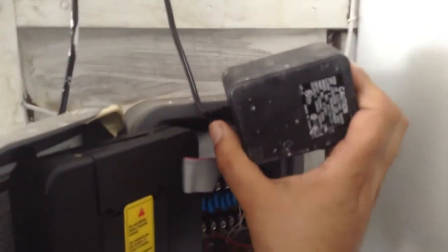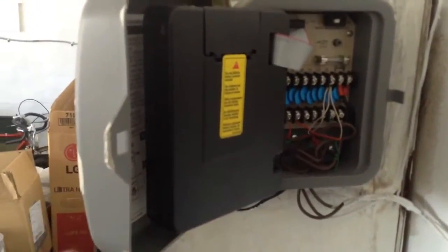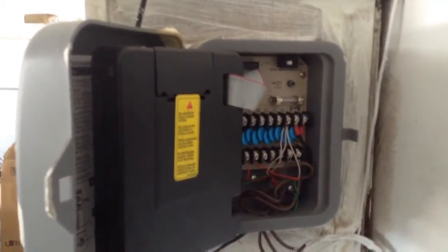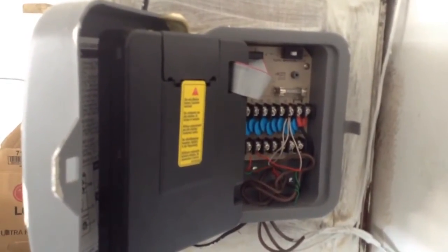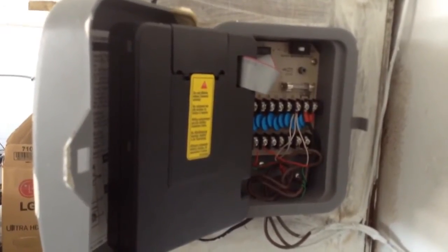What we're seeing here is a 24-volt input. When I check this, I find a wall wart — a voltage converter — that was taking AC current and converting it to 24-volt for this device to function, meaning this is naturally a DC-powered device. As a DC 24-volt device, it's not going to run directly off our solar equipment unless we're running 24-volt solar. So we're going to pull it out very carefully and save it for a possible off-grid application.